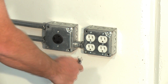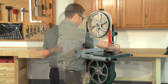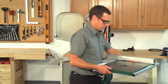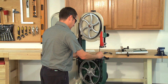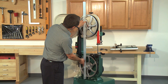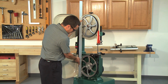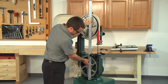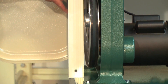To check the wheel alignment, first make sure the bandsaw is disconnected from the power source. Open both upper and lower front covers and remove the blade. Then remove the table so the straight edge can be set across both the upper and lower wheels. Reinstall the blade and make sure it is properly tensioned. Hold the straight edge close to the center of both wheels — it should touch the top and bottom rim of both wheels. Move the straight edge to either side a few inches and check if it still lines up the same. If it does, the wheels are coplanar and parallel and no further adjustment is required. If the straight edge does not touch the top and bottom rim of both wheels, you will need to make some adjustments.